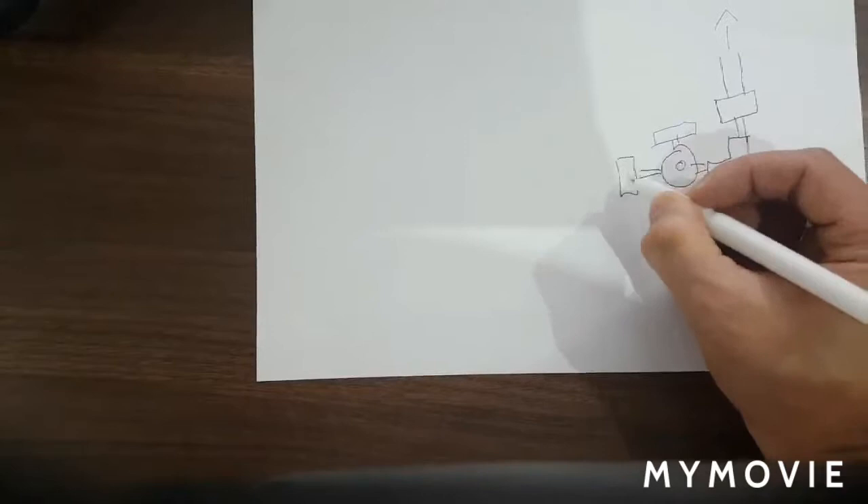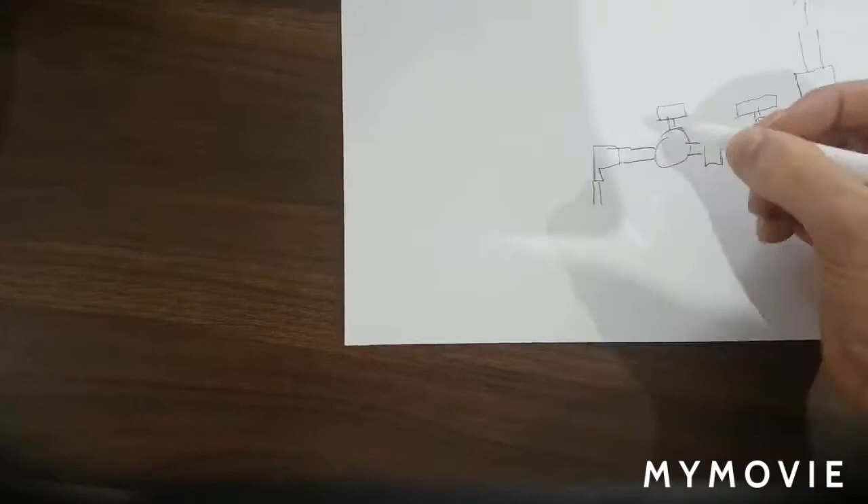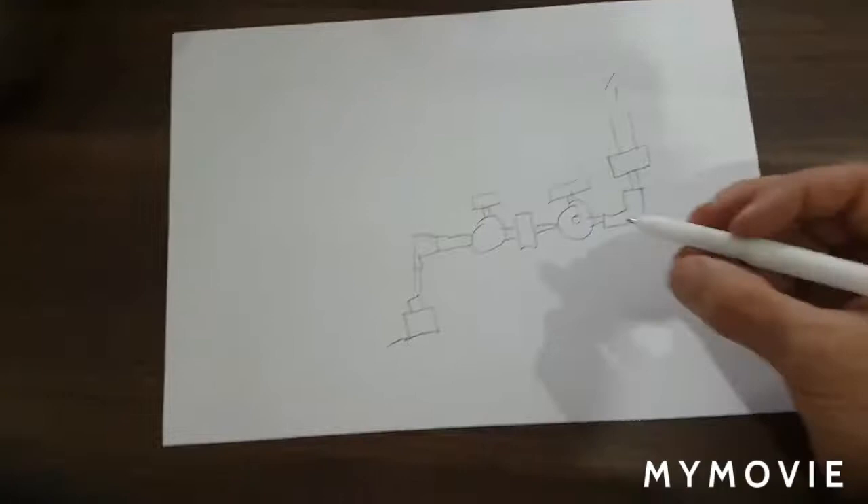From the tee fitting I'm going to have another union — excuse my drawing — which is then going to go to yet another ball valve with another tee fitting behind it, which will then come out, probably through a 90-degree elbow coming down, through some flexible hosing, which will then go to my return pump. That's what I'm thinking anyway.